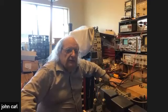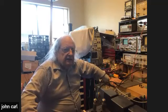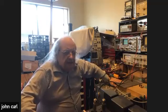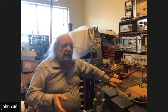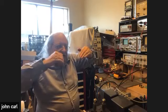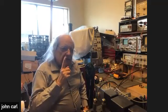In their case, they looked at correlation of amplifier distortion measurements. They had IM, they had TIM, they had harmonic, they had two-tone, CCIF, and SMPTE. They're different types of these things. And they had noise insertion tests. There was a test made by the Brits, which is basically a white noise test. You put white noise in, and you actually create a notch in the white noise so that there's nothing there. Let's say the white noise goes up to 10,000 cycles and then starts again at 15,000, but between 10 and 15,000 there's nothing. Then the receiving equipment on the other end looks only between 10 and 15,000 and sees what's been added there that shouldn't be there.